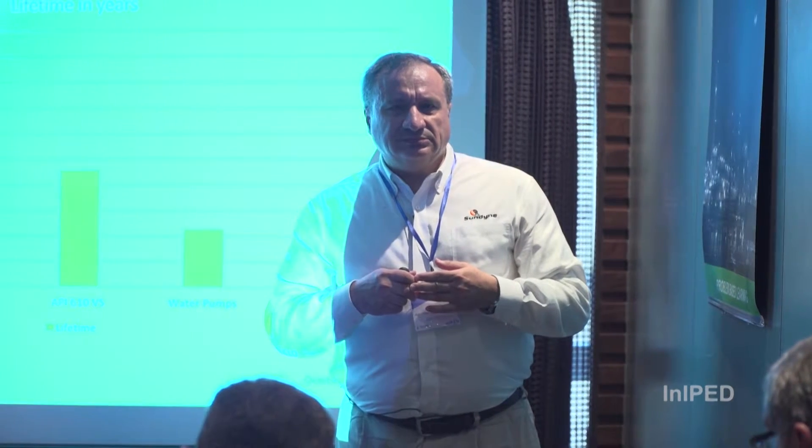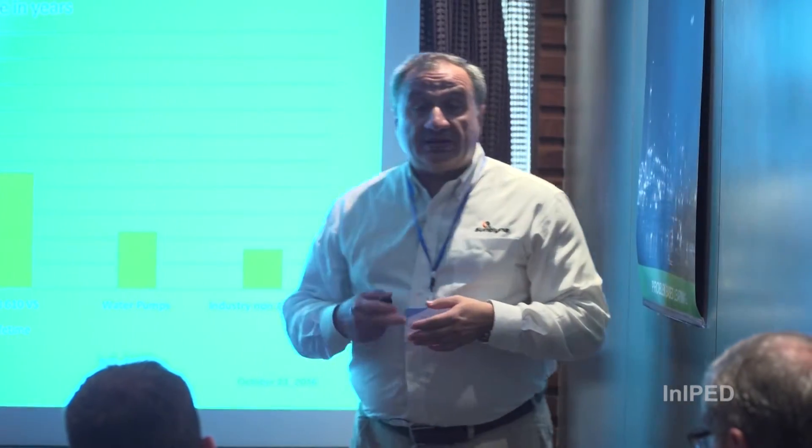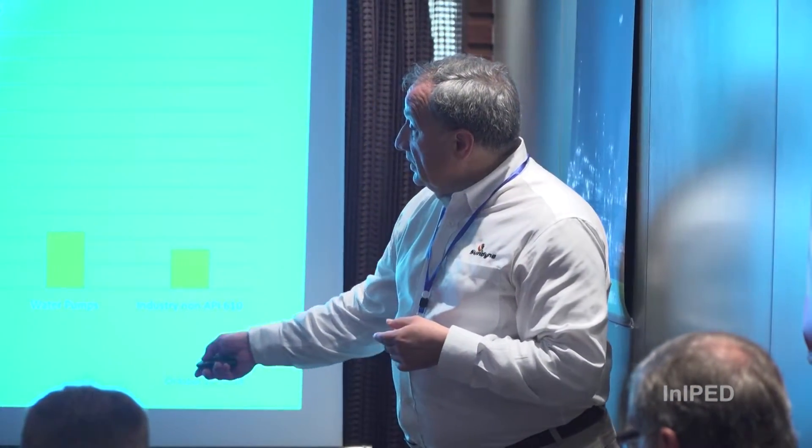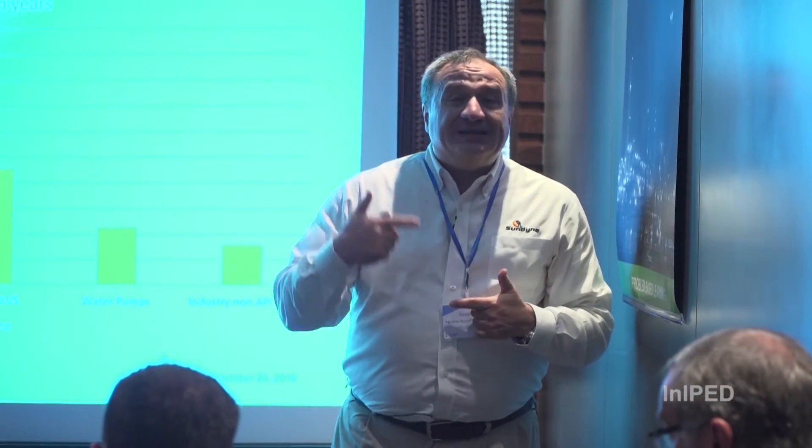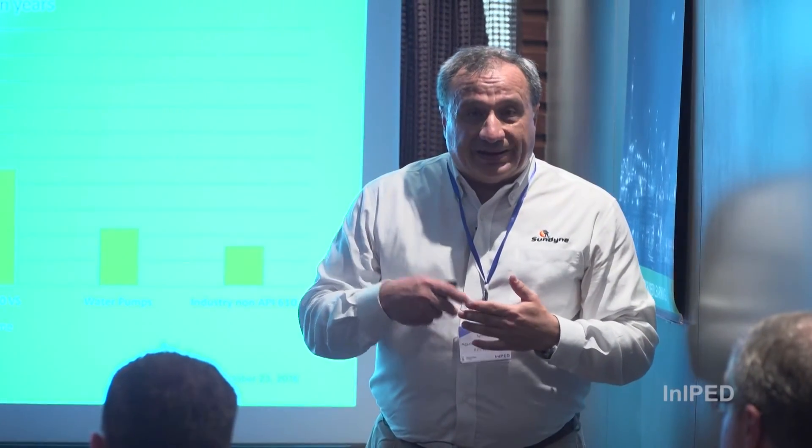In fact, I have been working with a refinery using API pumps fifth edition and they are working properly — those pumps are 35 years old. This is based on our internal data: all these pumps in different markets were produced by us, and fifth edition pumps are still alive, with impellers, casings, or mechanical seals being replaced and refurbished. The mechanical seal recommended for API 610 is either API 682 third or fourth edition. There is a program led not by pump manufacturers but by mechanical seal manufacturers, who are refurbishing these older-edition pumps to bring them into good running condition.